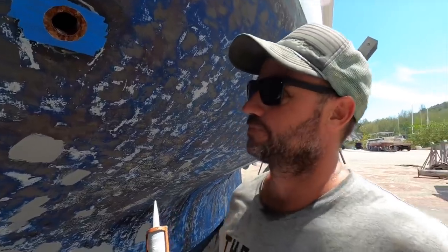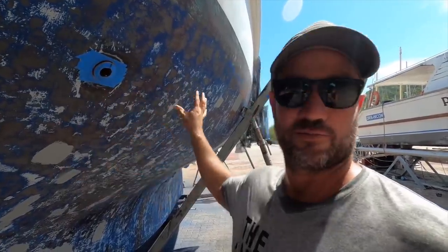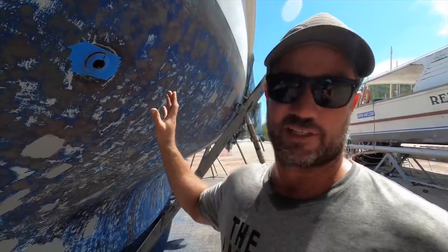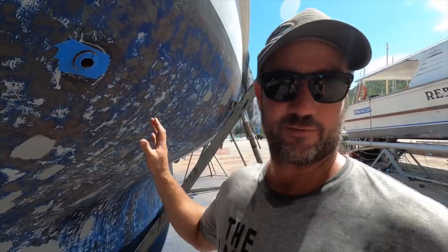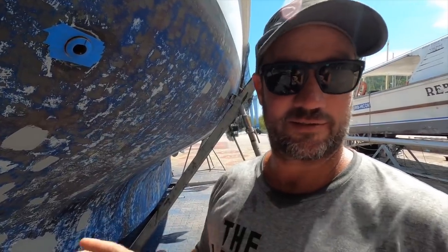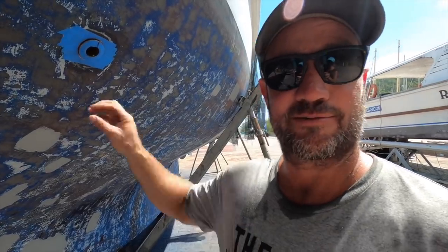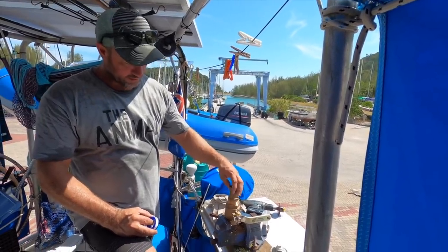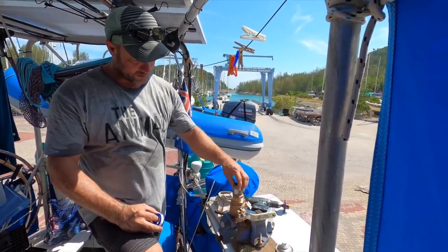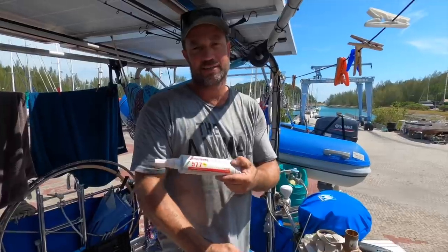No surprises? No surprises. Prior to this, we've actually gone through and set the whole boat up and done a dry fit before we use any sealants and made sure that everything works, everything's aligned, which it does in this case, so we're ready to put these valves in. All our fittings inside the boat from our valves will be taped and glued. So I'm using a Loctite.